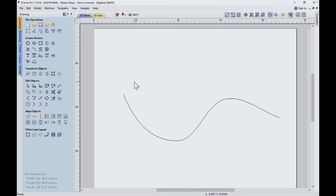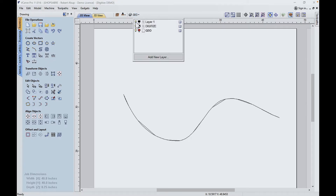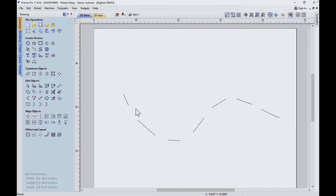Think about this as just being one of the shapes that came off of a template. The template goes on the machine, we've got a pointed bit, we jog the machine over to where it points right over this point right here and we click it — it would say, okay, select that point. Then I go to another point and another point and another point. The more change in geometry, the closer the points. What the digitizer is doing is creating straight lines in between those points. Now let me show you what the digitized output looks like. So let's turn this layer on and that layer off — so this is what you get. When you open it up to start with, you'll actually have lines from here to here. If I hit the node editor, basically these are line segments.